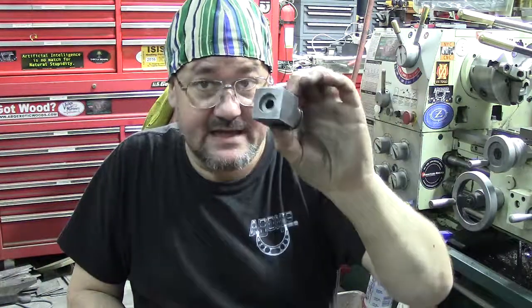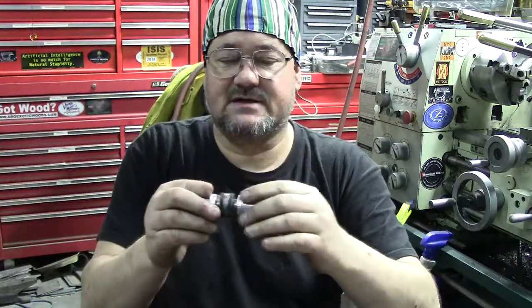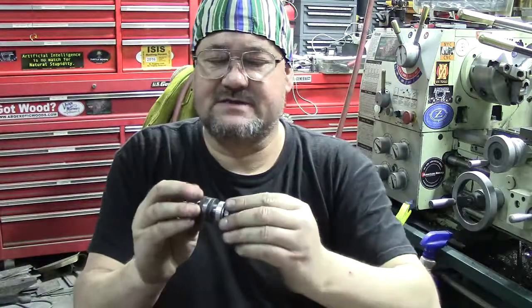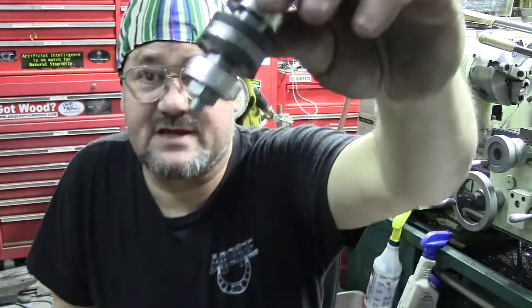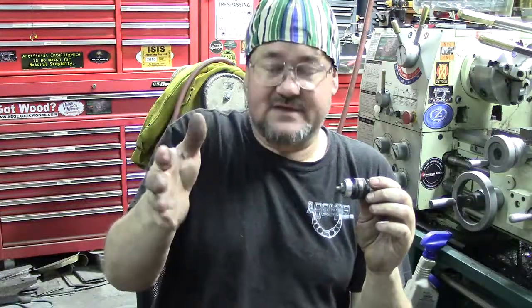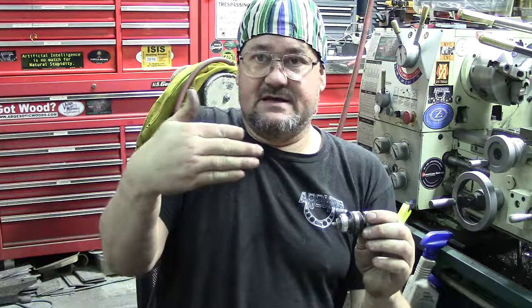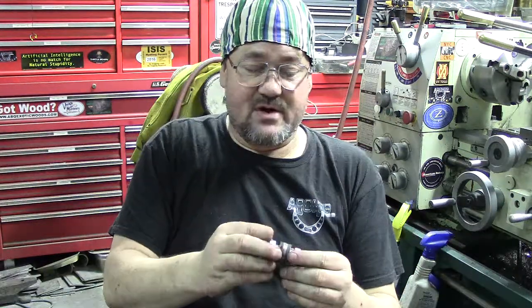So, taking this apart to change the O-ring, when we pulled the piston out, it's got leathers. Now, I made this little kind of thing here, and you can see the leathers are not in the best shape. Okay, you can see where they're chewed up. So I know whenever I would have this cycle through the X, at certain times it would go like this, and then it would go back, you know, in cycling. So we got it apart.